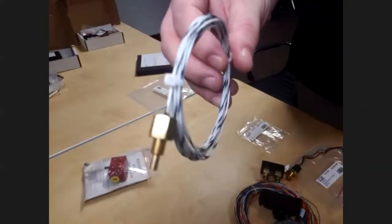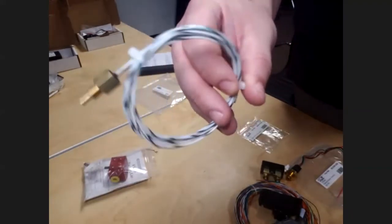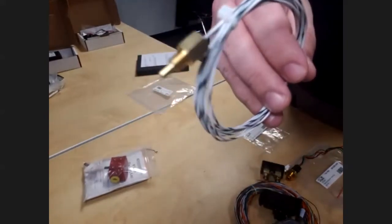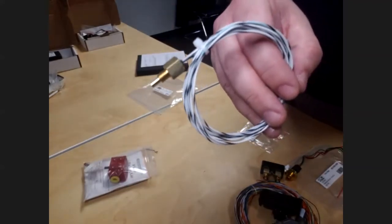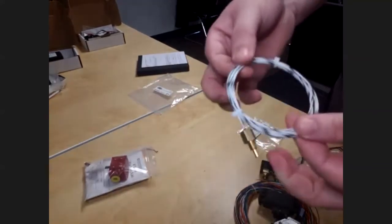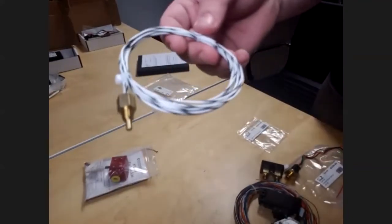The other thing this is nice for is you can set an alert to configure if it looks like the air temperature in the carburetor is getting close to freezing, which, as we know, is an easy thing to do in a lot of conditions if you aren't thinking about it and paying attention to it. So this can grab your attention before you start to lose engine power because icing's developing. You get ahead of the time warning. Plenty of length of wire. Again, this will go to the D37 engine harness and bring that information to you in the cockpit.